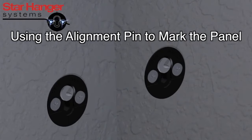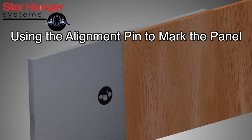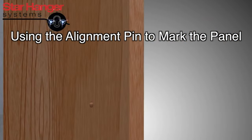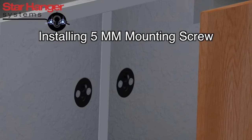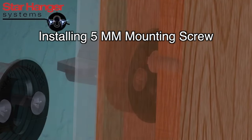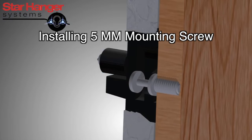The star one and three-eighths inch hangers do not have to be set in any exact location. We have an alignment pin that fits into the key slot and marks the precise location of the mounting screw. Set the alignment pin into the bottom of the key slot. Carefully position the panels over the alignment pins in the location that you want to mount the panels. Firmly press the panel against the alignment pins to mark the location of the mounting screws. After marking the panels in the field, use a five millimeter brad point drill with stop to pre-drill the mounting screw hole. Our five millimeter mounting screws are precise and strong — they can be installed in seconds.